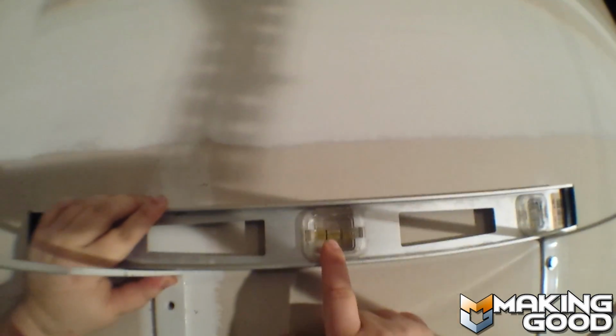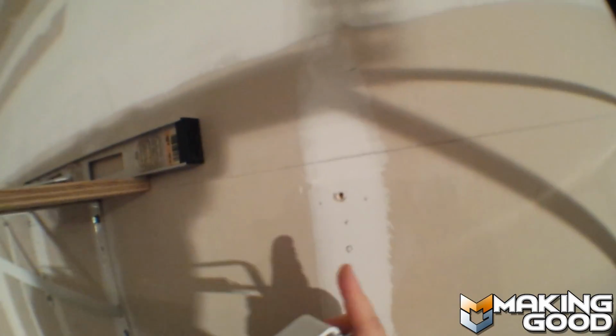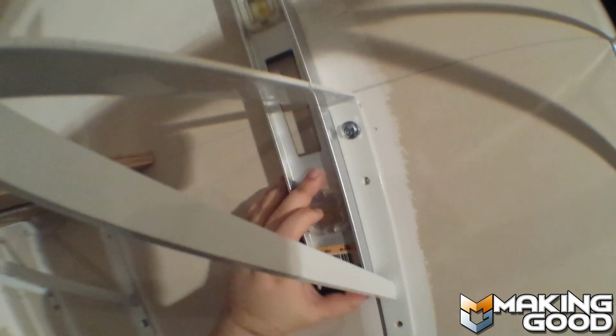Repeat the same process by lining up the L bracket to the line. Drill the pilot hole. Secure the bracket to the wall with a lag bolt. And then take your level and make sure that it's vertically aligned, that it's level, and then drive in that lag bolt. Drill your pilot hole on the bottom one and affix it to the wall with a lag bolt.